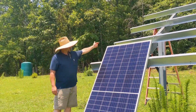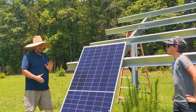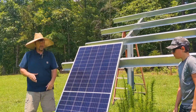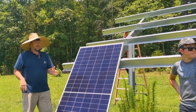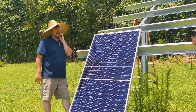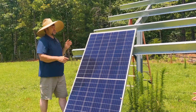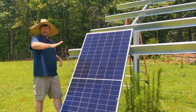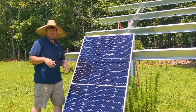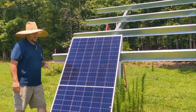We'll start our first panel here. What I like to do is set a dummy panel at the end to kind of eyeball the bottom edge — I just eyeball it like I'm shooting a gun. I got my rear sight and my front sight on the corners of my panel, I line them up and go with it. A lot of people try to fight with measuring off of the purlins, but I don't go by the purlins. As long as your purlins are planed out and it's square, it's good enough. We have a plane established that we're going to put these panels on — how they're oriented is based on the eye. I don't set a string; I've done lots of these.